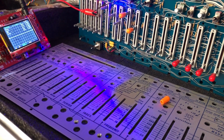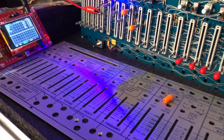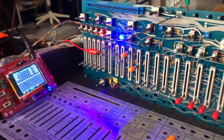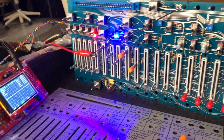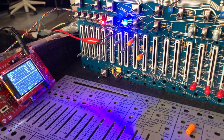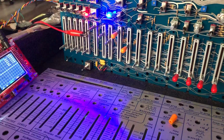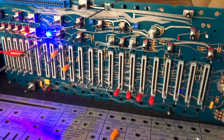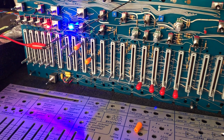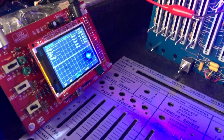I did the first check that you sent in the email, and there was an issue with card 3. I was not getting 13.5 volts on pin number 4. I corrected some resistors which were not soldered very well, so now they are okay, and I get the 13.5 volts value. On card number 6, pin 4, I was not sure what I should see. Maybe some signal on the scope, perhaps.